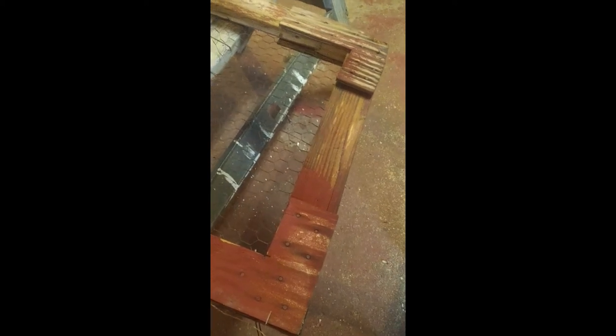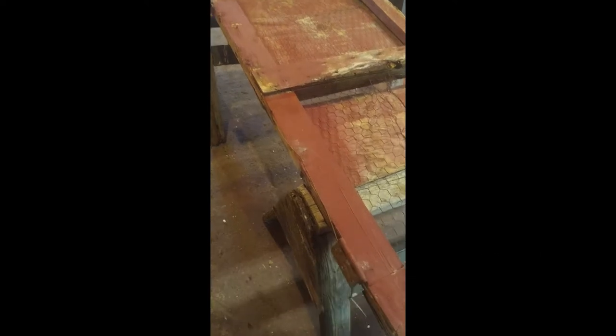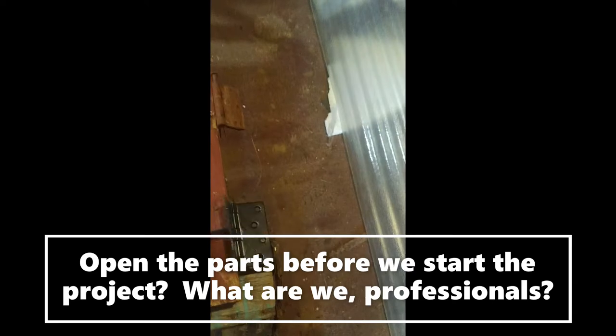I have a kit we're going to use to make these corner pieces — instead of cutting plywood on crappy two by fours, we're going to use a good two by four all the way up and put some 90-degree metal angles to hold it together. The top is not at 90 degrees because the roof slants, so the door is going to slant, but at the bottom we'll have a straight 90-degree bend. We'll oil up the hinges and make the hardware better. We're still going to put a piece of plywood on the lower half and use some clear plastic sheeting for the window up top.